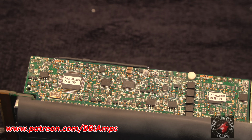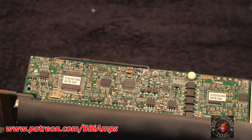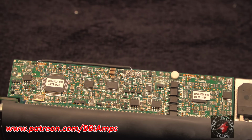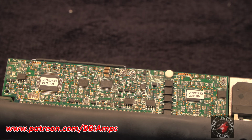Now I stole this from, I won't say stole this, but I found an article on Reddit about this power supply and how one particular person modified the supply so he could get away from the 12 volts. When you get this thing out of the box and you put 110 volts to it and apply the jumper that makes it turn on when the voltage shows up at the power plug in the front over here, this plug, his goal was to achieve 13 volts. You can't really get there. You can get to like 12.8.